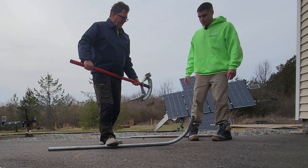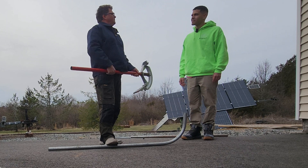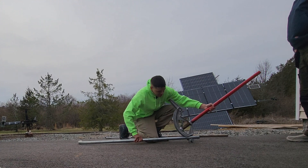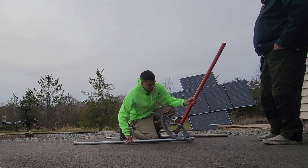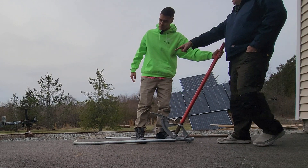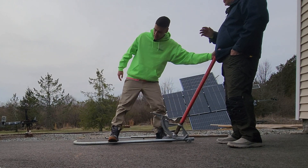And that is how, even at 60 years old, you can bend. Hell yeah. Leave at least two inches sticking out of the shoe — right about there is good. Now, you do have a 90 on the back of this piece, so you want to step on that 90 and get it level. Step on the back here — you want that level to the ground.